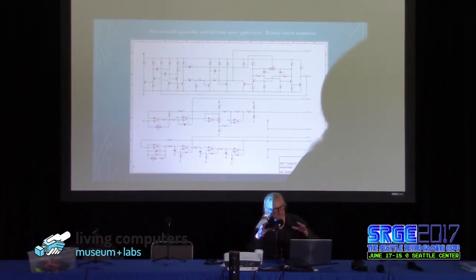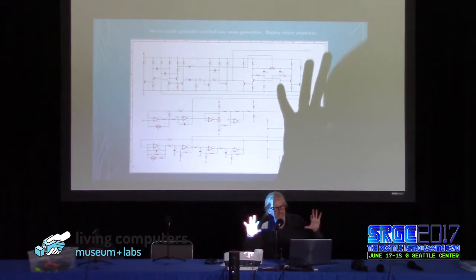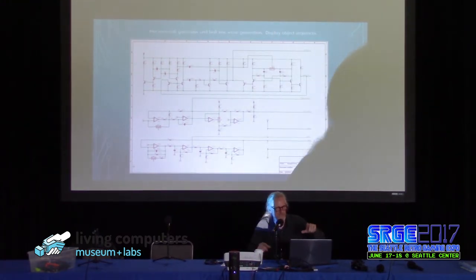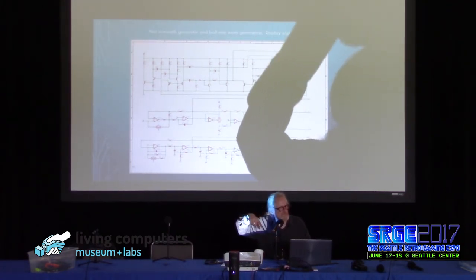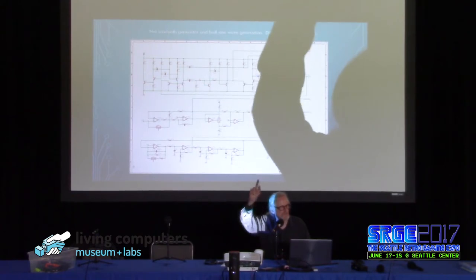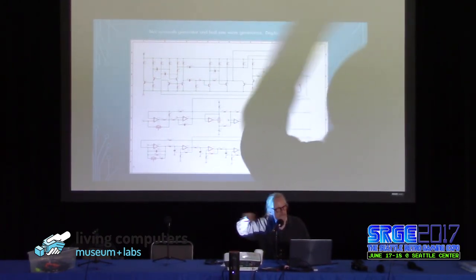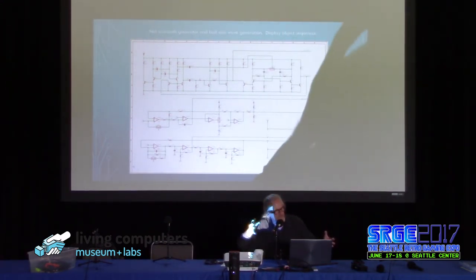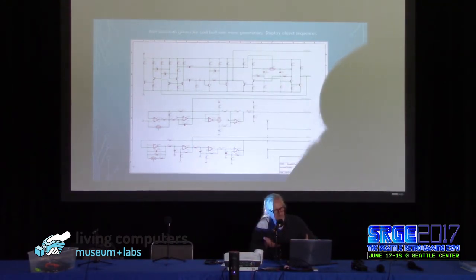And the whole point is this center section gave me more control. I wanted to get the brightness of the ball, the net, and the court the same, because they're different sizes, but they're on for the same length of time. So by controlling that, I would ideally improve the game. In the center here, to make the net in the original game, they took part of the 60 cycle hertz and used that to wipe in the vertical direction and in the horizontal direction for the court, holding the other axis constant: hold the X constant, vary the Y, or vice versa, hold the Y constant, vary the X for the court.